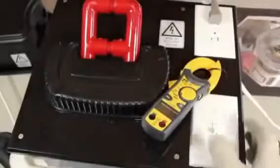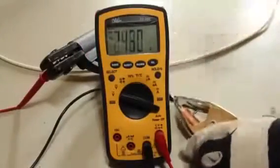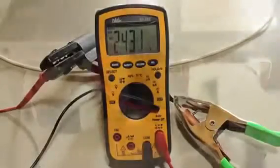If you remember back to when we inserted our new secondary coils, I mentioned it didn't really matter which way they went in, and here's why. When the power is on and our welding electrodes are connected to a multimeter, we should expect to see around 36 volts, but here we're only getting 2.4. That means the transformers are canceling each other out.